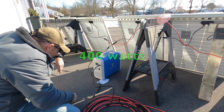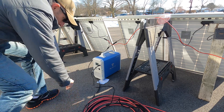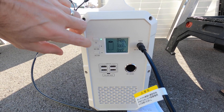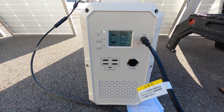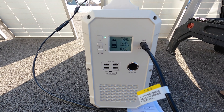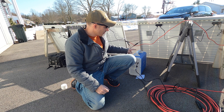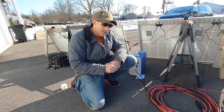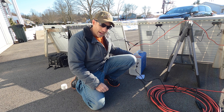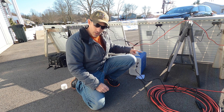200, 300, 400, 480 - it's going up to 488 watts. We're at 488 watts. My panels could be turned a little bit and it would be a little higher, so you can definitely hook up six panels to this thing. It looks like you can easily hook up 600 watts of solar panels to this Bluetti. With these six panels hooked up you'll get pretty much the max amount of wattage and the max voltage you can put into this.